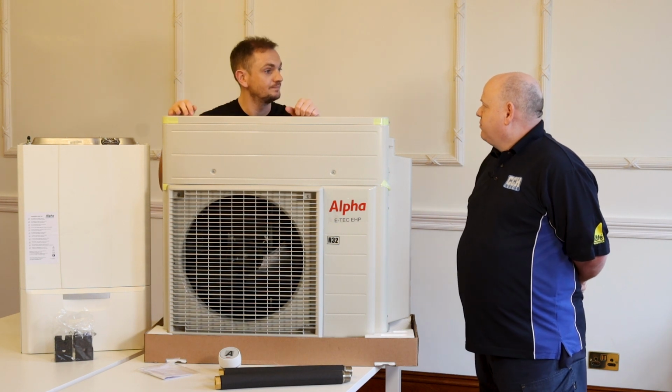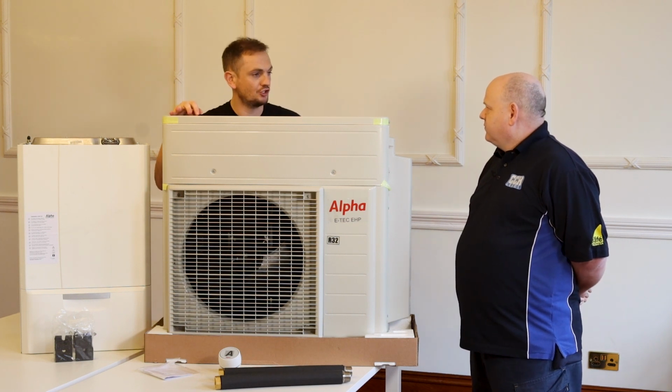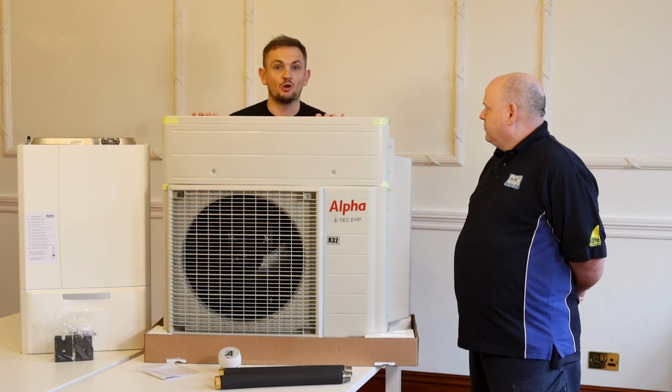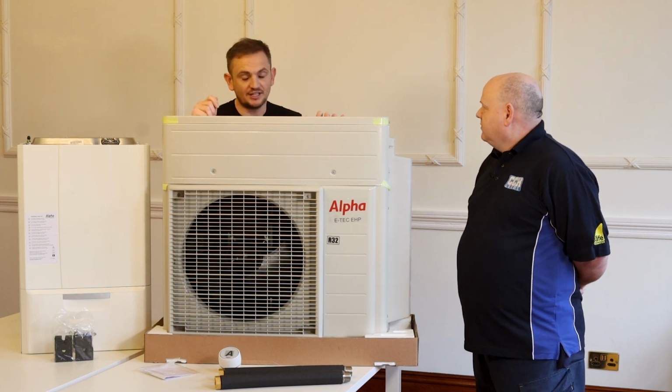Would you have to get onto primary pipes, use 22? Yeah, so get onto your primary, you couldn't take it off 15. So go onto your primaries, get onto your return, okay? Then, because it's such low power, like a 2.5 kilowatt power rating, you could actually run this off a plug. So you don't need a DNO then? You don't need a DNO application.